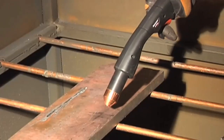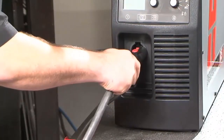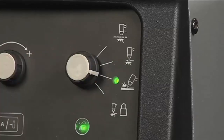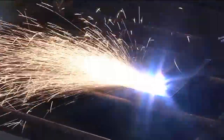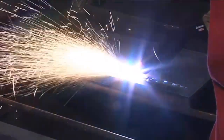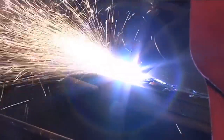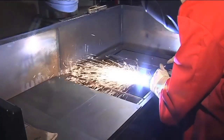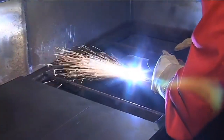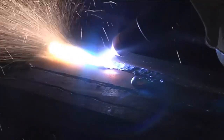To gouge, I'm going to use the new Duramax H65S torch, which already has a gouging shield and nozzle installed. I'll swap the torches, set the mode switch, and I'm ready to go. This is our new torch design, but our regular torches work just as well for many gouging applications. This unique semi-straight design gives me better control and gets my hand further away from the intense heat. To begin, hold the torch at about a 45-degree angle to the metal, pull the trigger, and then begin moving the torch. I can get different groove profiles by making multiple passes or using a weave technique.